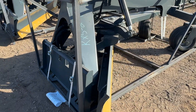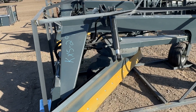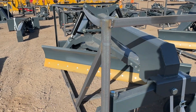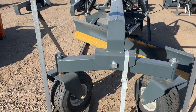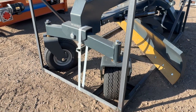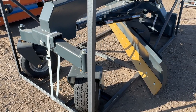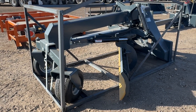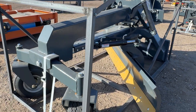Here's a better look at it. One of the things I always did on my graders was to foam-fill the tires right away. Otherwise, with all the pressure on the tires, you end up popping them right when you don't want them to pop. And that's your handy heavy-duty grader.